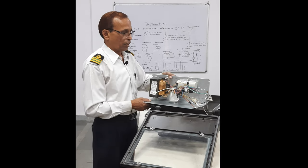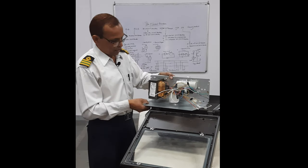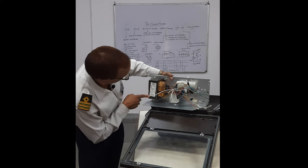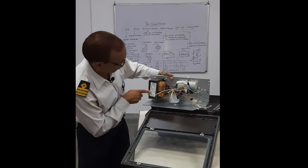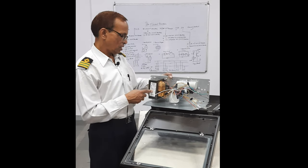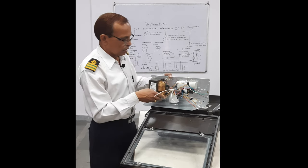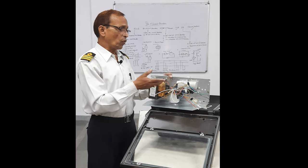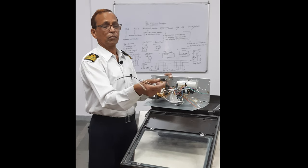This holder size is E39 or E40. Then you have a transformer — Philips, 220V, different connections are given. Your lamp is connected to it. Then you have the capacitor. Only a few wirings are there, and then you have the power supply.